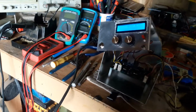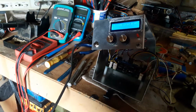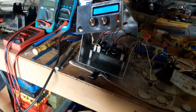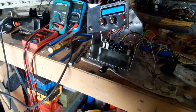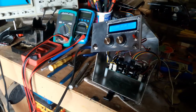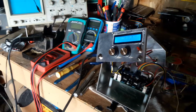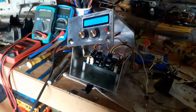If I bump it up into the 2000 PPS or the 3000, well, at 3000 the detection distance drops to half, and it'll barely detect the nugget, and then the coins, the tops is about 6 inches, 3 to 6 inches, and then anything lower than the 1000, the coins do good, but it doesn't do anything for the gold. Gold rings like a few inches, nugget won't even detect it. But so anyways, I just wanted to update you on that and let you know, so we can go from there as far as the code.